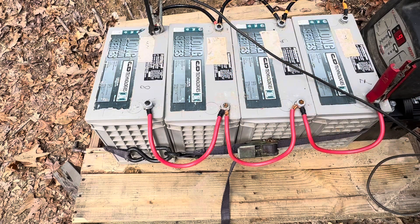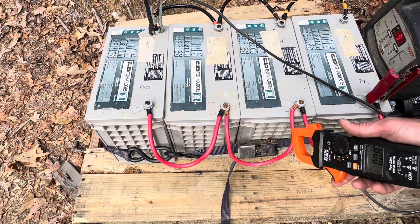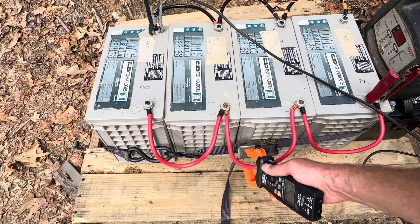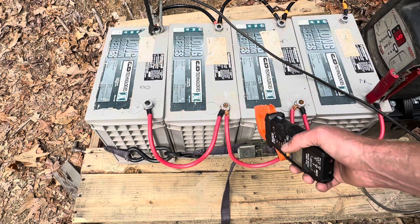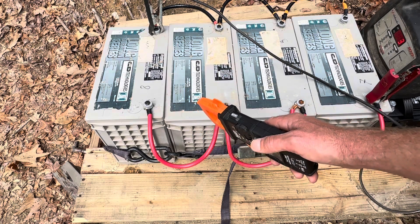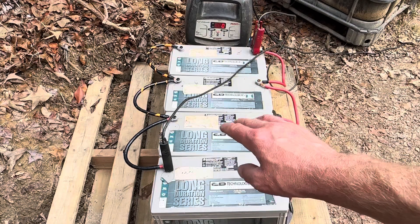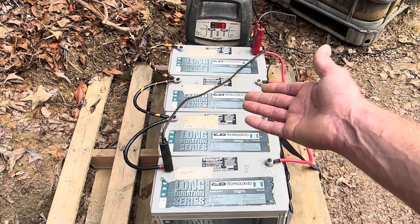We're getting 7 amps out of the charger. Near the charger: 4.8 amps going to the second battery, 3.2 going to the third battery, and the furthest one: 1.52 amps. Still not equal - they're not going to pull the same amount of current or be at the same voltage due to resistance in the wires and between batteries. Even with identical-length interconnecting leads, one battery is going to draw differently than the others. This is better than the first method but it's still not perfect.